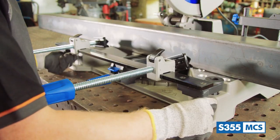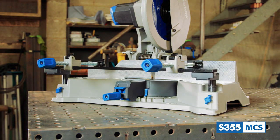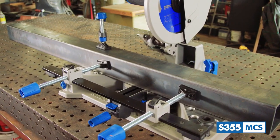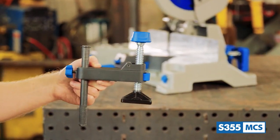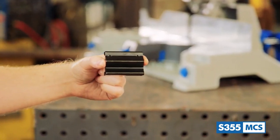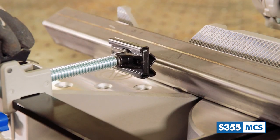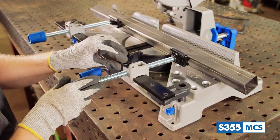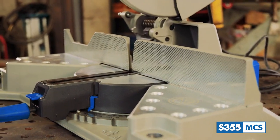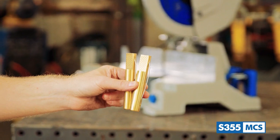Another great feature of this clamping bar is the ability to adjust the height of the bar itself. The height can be raised or lowered in a variety of different height settings to best suit the safe securement of the stock being worked on. In addition to the front clamps, also supplied with the machine is this quick-release top clamp. There are three v-block adapters also supplied which can be slid onto any of the front clamps or the top clamping — useful to give a firmer grip on some types of metal stock from angle iron to square tube. The base also features holes for compatibility with bench dogs as optional clamping accessories.